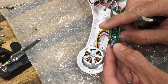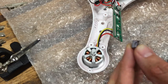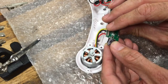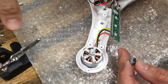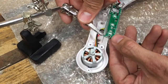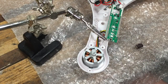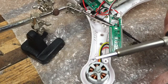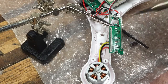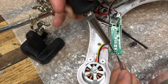All right, we have that — it's cut to length. Next step is we're going to solder that on. There's already solder on the board, and my guess is the leads are still stuck in there, so I'm going to try to remove those first. I'm going to get my helping hands and hook that to the circuit board carefully so it doesn't move around. I have a very fine point tip on my Weller WES51 soldering iron and we're going to go in there and try to remove that existing capacitor lug.